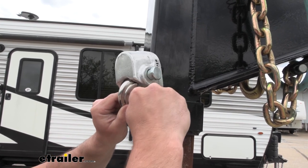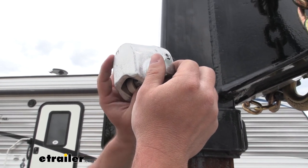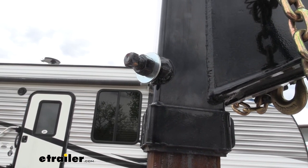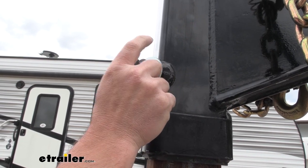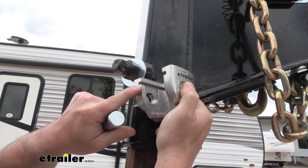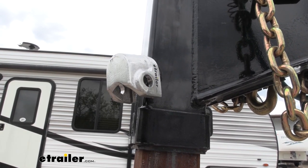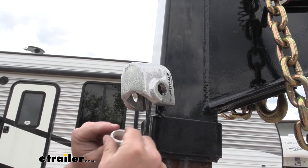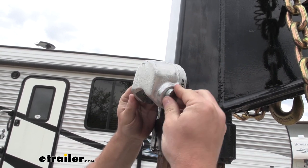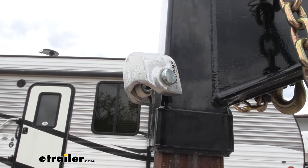We're going to remove the padlock first — just turn the key. Set that aside and we'll remove the pin in the middle. There's also a bushing in there to help take up space. Remove that and we slide this off the washer. To install this, back off the set screw and completely remove it, then put the washer in place so that the cover has something to slide into. You can see the groove here — that's where the washer slides in to help hold it in place. Then we just go through the process in reverse: put our bushing in there and our pin to go right through, then add our padlock. You might have to move the bushing to the other side for more room to get that padlock to go through.